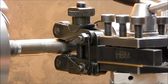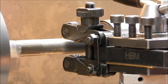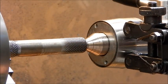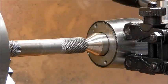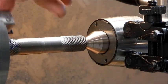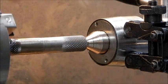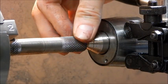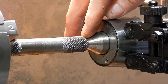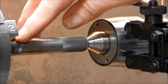When you're done you just back it off. Let's see what sort of a job we've got. There's your knurl — easy as that. Now that could go heavier for sure. I can come in again and go over it again. I really didn't put enough pressure on that; this is pretty hard steel.